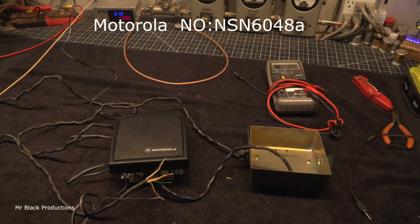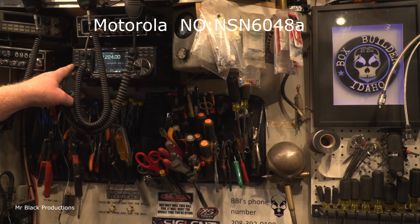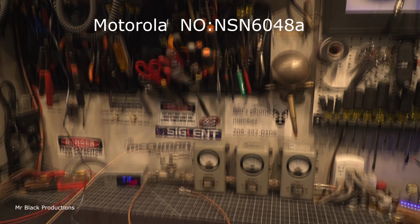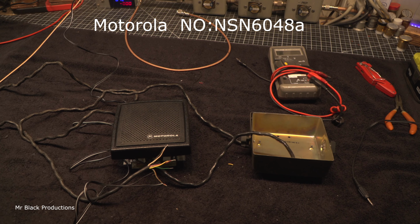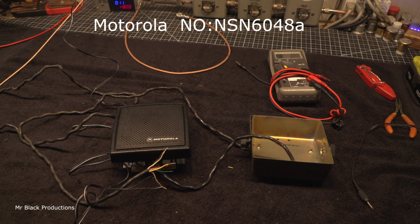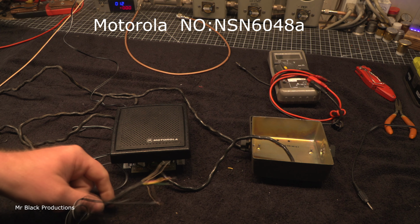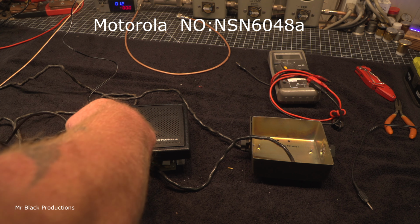Which I'm just going to have hooked up to my ICOM 7300 on the headphone jack. So we're not even going to be giving it the full 4 watts. It's like a two watt standard on the headphone jack, where the external speaker jack is a 4 watt standard. So we're only going to be giving this half the amount of input signal that it actually requires.